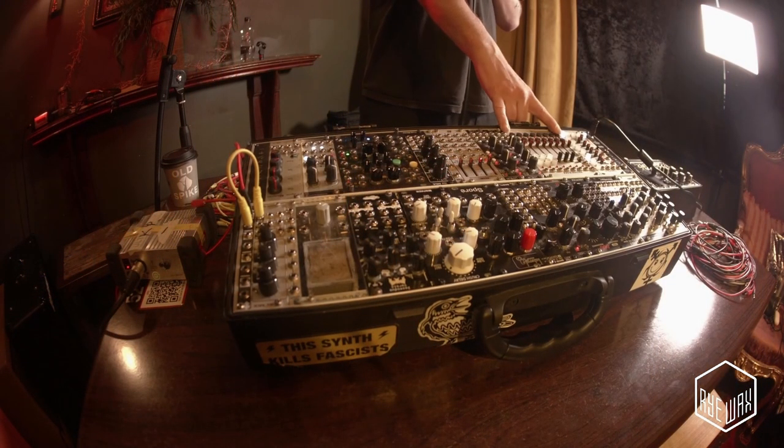The good thing is nowadays, since Doepfer invented the Eurorack standards, all of these modules that you can see in the case here are the same height. They're 3U, which is standard rack height that you find in 19-inch rack stuff. They all use the same width measurement, called HP. It stands for horizontal pitch. If you look it up online, there's a really fun 500-page thread of people coming up with stupid variants on it. Hippo points is my personal favorite. So that's how you measure the width.